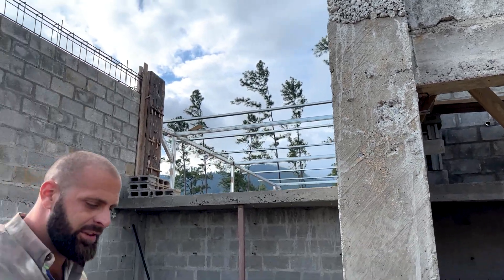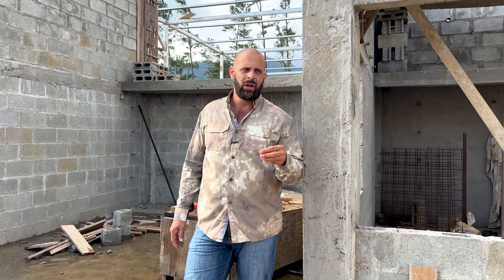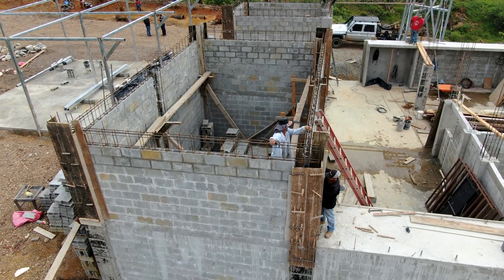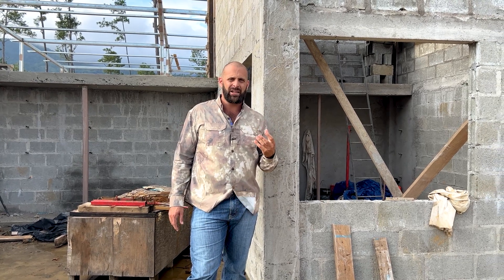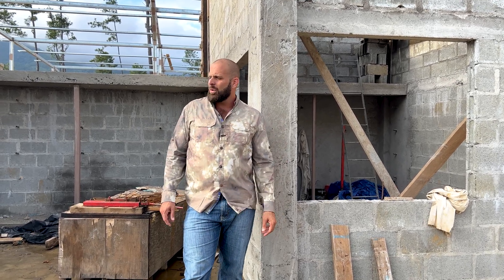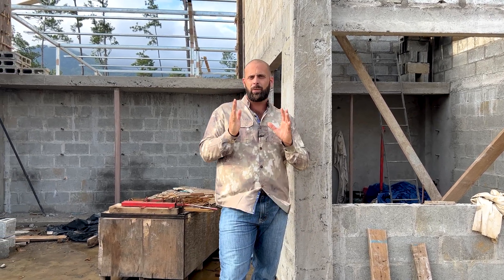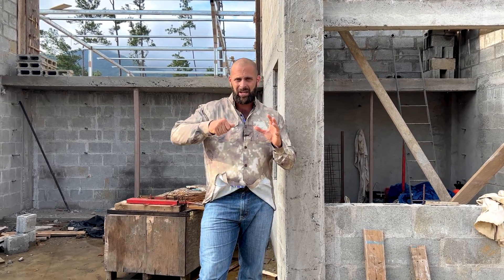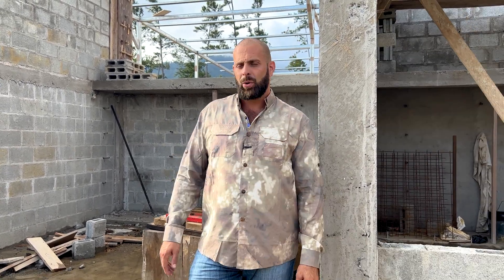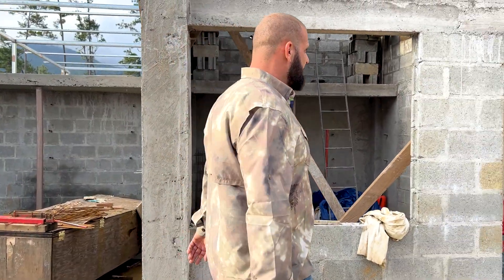It might look weak right there but it's actually not that weak. Some guys will say you've got to demolish that column — well, that's not necessarily true. I am going to have to do some further work to that column, not because it's weak, but because I don't want the metal rebar reinforcement inside rusting and in 50 years the column crumbling due to oxidation. What I'm going to do is use an epoxy made specifically for concrete, break it up a little, reform the column in that spot.